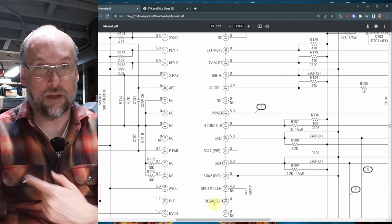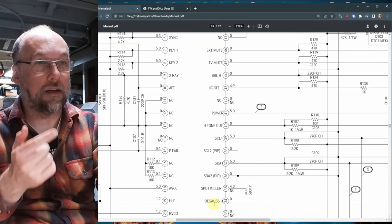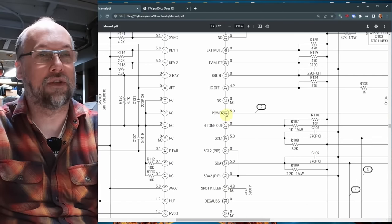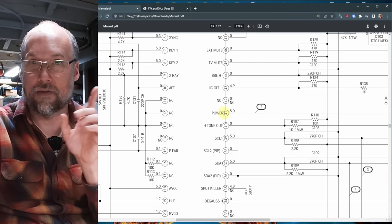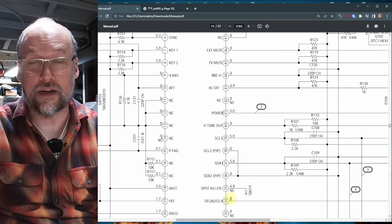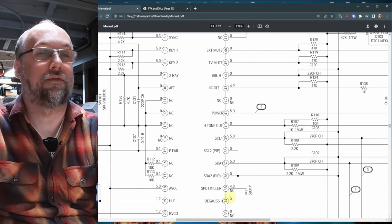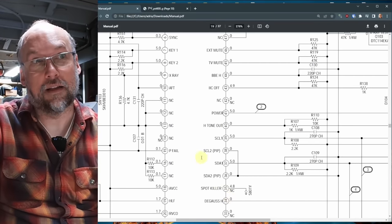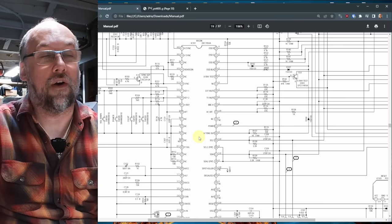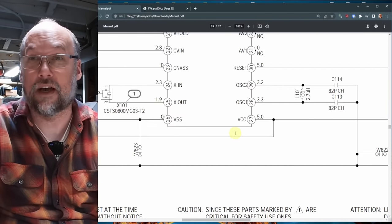And well, the set earlier was just starting up after like one click, and I could see that this power signal would stay high. The reason it says 5.0 volts is, I think, all the voltage readings on this schematic are for when the set is operating. But the degauss circuit output here is 0 volts because the degauss only stays on for a few seconds and then it clicks off. So why exactly is the microcontroller turning on the set and then immediately turning off the set?